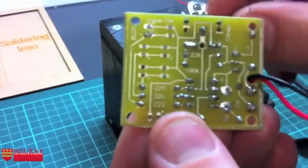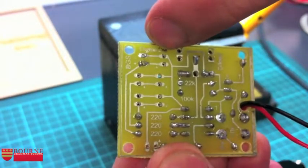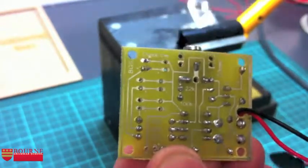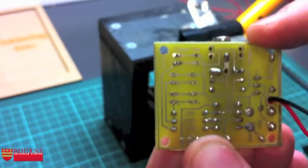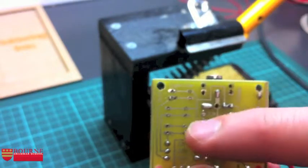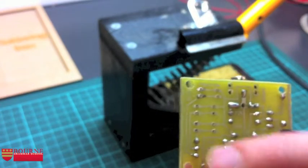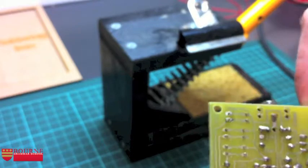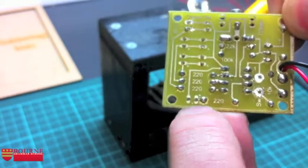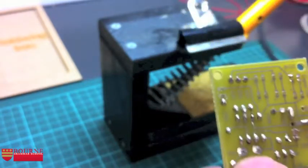Okay, so I'm holding my PCB in my hand at the moment, and what I can see here is a couple of spaces here that are connected. You see those two? Those are going to be two of my LEDs. The positive end has actually got a little teeny tiny plus written next to it as well, so I can spot that. What I've also got further down is two more LEDs that are going to go just here, and then one all by itself right down at the very bottom. That's down just here. Okay, so LEDs there, there, there, and there. I've also got my switch, which goes next to the letters SW, which is located here.